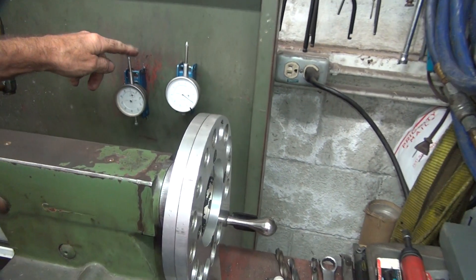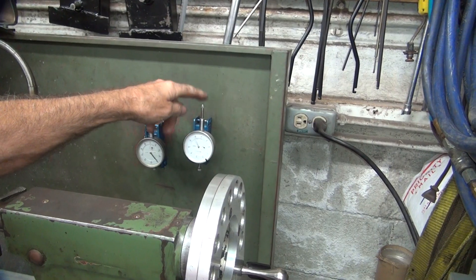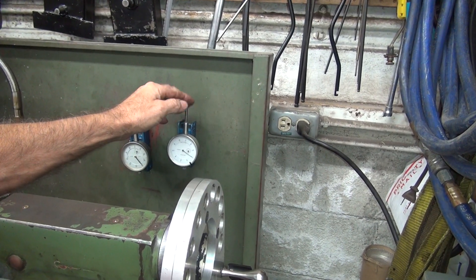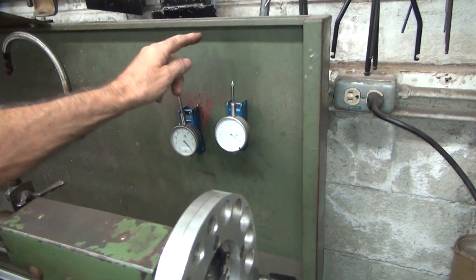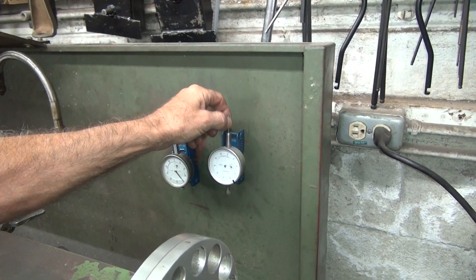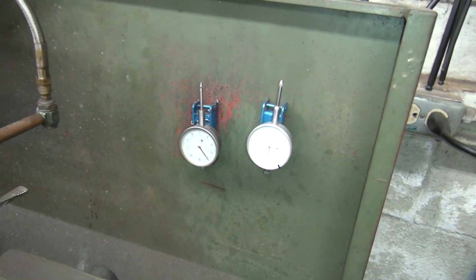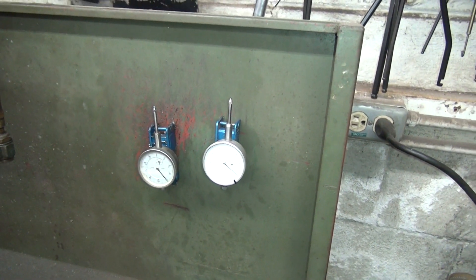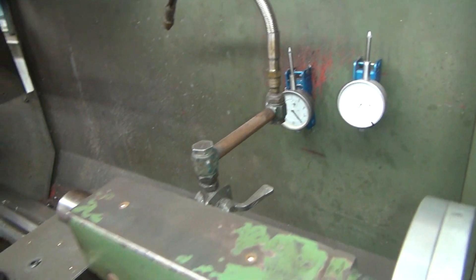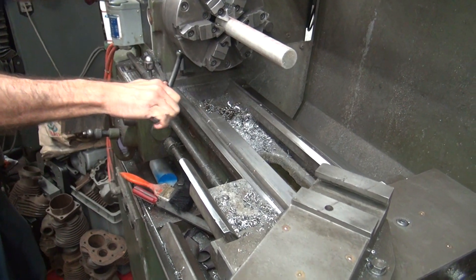Which one's more accurate — how do you tell? I'm thinking that one's not as good as this one here. It comes back a lot quicker. That one's not quite as good — maybe they dropped it too many times. It's getting a little freer but there's a high spot in there somewhere. Yeah this one's a lot better — I don't think we'll use that dirty one next time. It's not tracking very true. It's got a weak spring and some built-in drag — it's dampened. Okay, I finally got to zero.